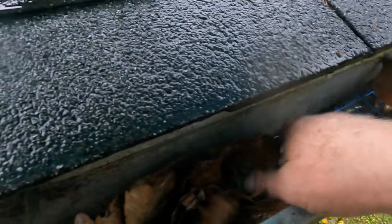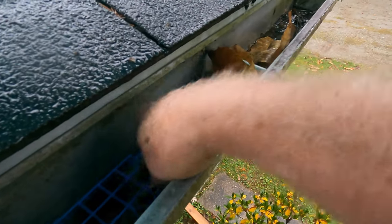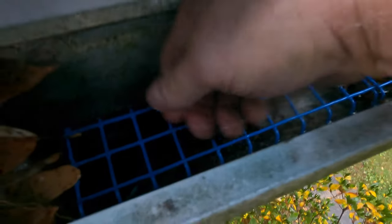That one's overflowing. What I would do to improve this is put two or three filters here in line, like that — that's even better. You put two or three in line and you never have to worry about this gutter for a long time. Now let me explain the principle: this is a low-profile leaf filter, so even if it clogs in the front, the leaves can clog there — that's fine. Leaves can go over it. You can see how the small debris flows through.